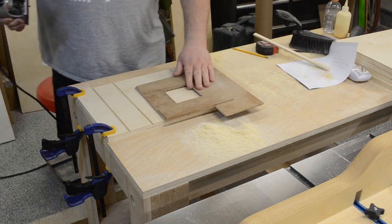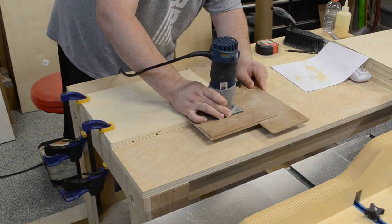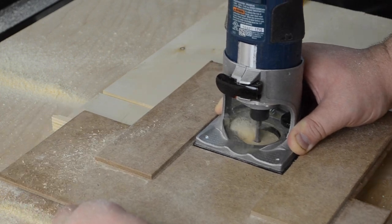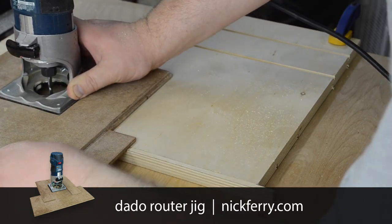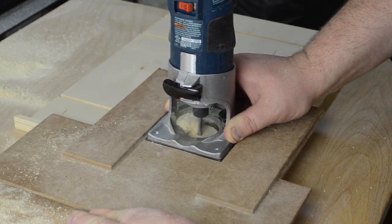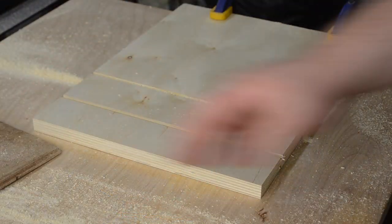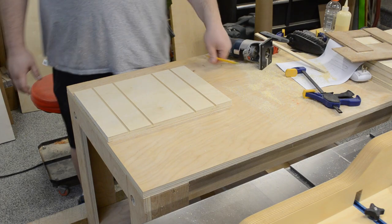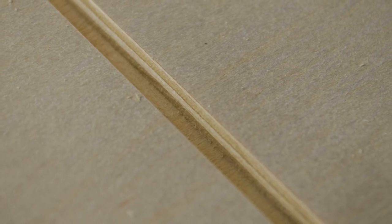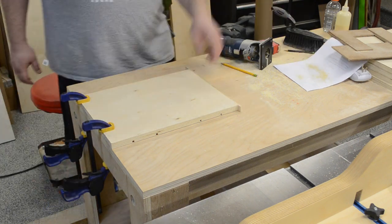I debated adding a dado in the center, but I just saw it as unnecessary as I really wasn't going to use that portion of it. Using this router jig to cut the dados went really quick — I'll have a link in the description below if you want more information. You can see me adding that spacer for the first cut and then the jig slides right into that cut. I'm using a spiral downcut bit, quarter-inch diameter. You could use a spiral upcut bit because the downcut bit can clog with chips occasionally, but you can't argue with the results — that downcut bit produces beautiful, crisp, clean, tear-out-free edges. For the end pieces I cut dados on just one face, and for the three center sections I cut dados on both faces.